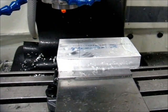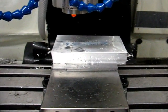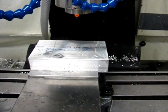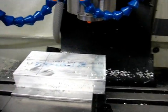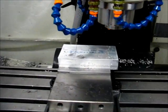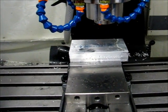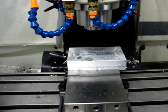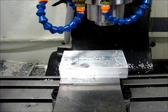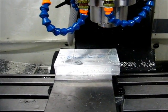I'm test running the code right now. Everything looks good as far as the tool position is concerned. There are some really light cuts here. I normally take a depth of cut at this feed and speed around a quarter of an inch — 250 to 270 thousandths. This is a depth of cut of 100 thousandths, so it's way under that. I'm not pushing the tool at all.